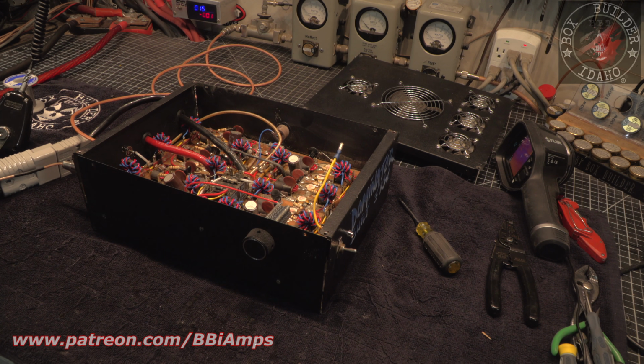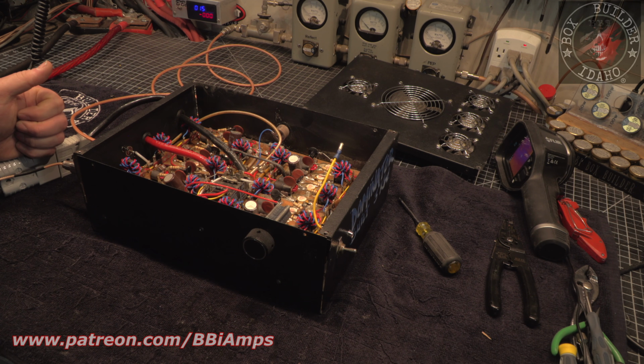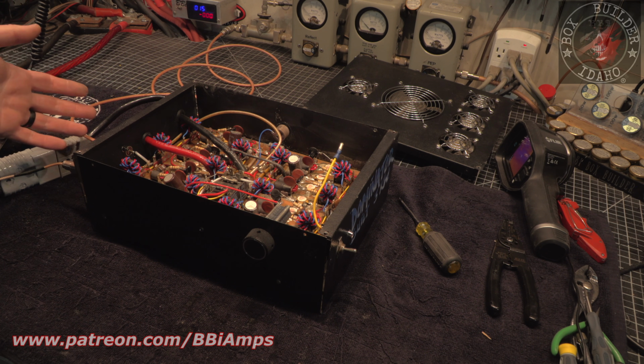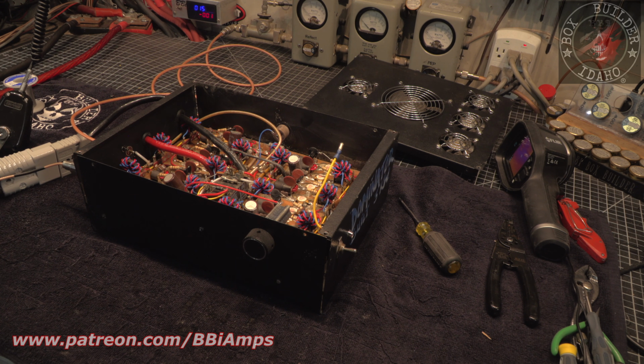So let's see, what is a 16-pill? Well, it's 400 amps. How do we know that? Each transistor roughly pulls 25 amps, and we times it by 16. That's 400 amps worth of draw. This 175 amp Anderson clip. I had a guy say this to me yesterday: I hate them Anderson clips. It's like spooning with your wife at night. You're not getting a good contact. There's no penetration going on.